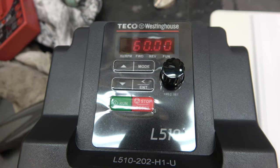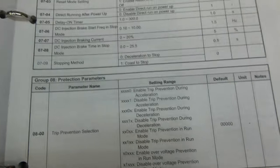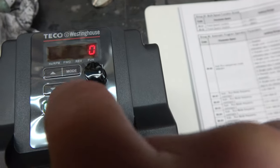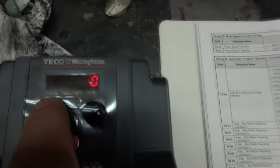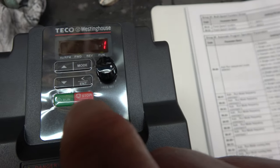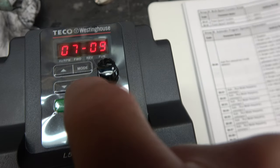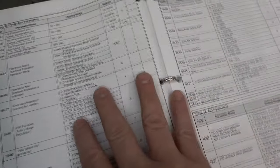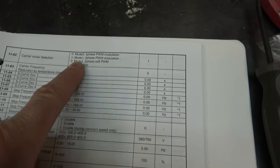Here's the stopping method — coasting to stop. It's 0709, set to zero. I want coasting stop, so we'll go to 1. For mode selection, everyone's setting it to three-phase — so it looks like we're going to set that to zero, so 1102 to zero. When I was programming the first VFD, the tech on the phone said you want this set to 16 for the carrier frequency. Let me crank that up to 16 — it's 1101.